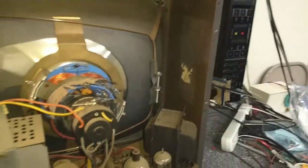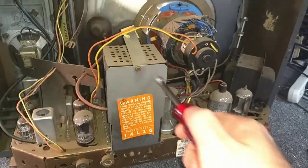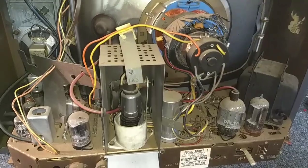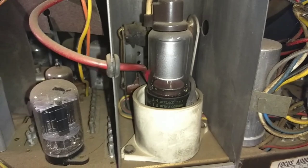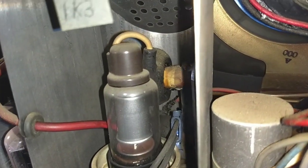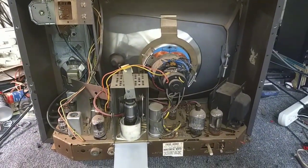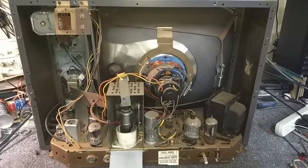There was a tube diagram there but it's obviously gone. Let's take a look inside the high-voltage cage. Probability of there being an original high-voltage rectifier — placed with original Zenith tube. Probably a 1B3 or 1K3; the donut looks pretty good. Only minor cracking, no signs of carbonization or arc-over. That's good. The next thing to do is get a CRT tester on it and see what that says.